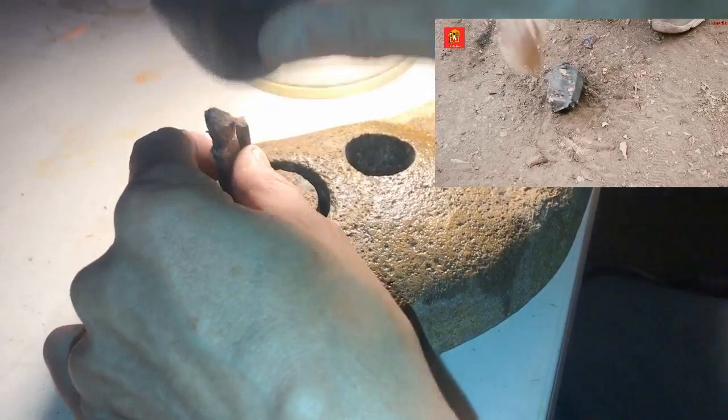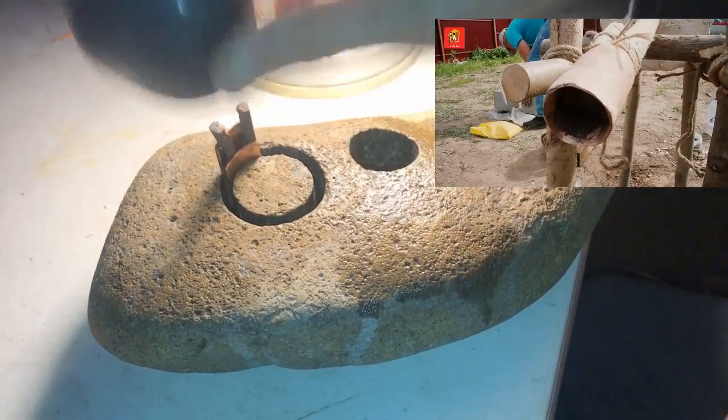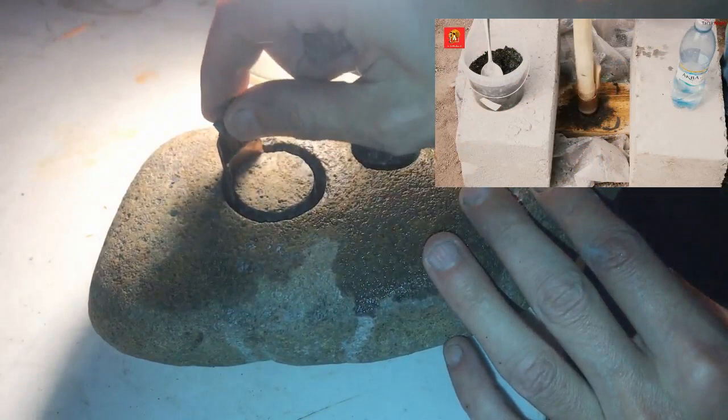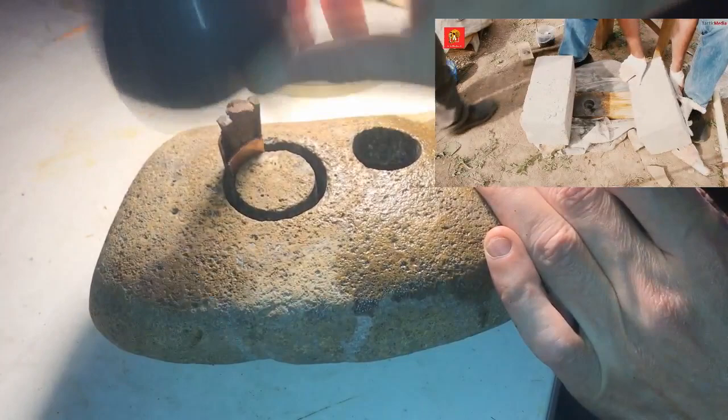the pipe will only be so long. But you drill down to that depth, and then you just pop out the core, and then you keep drilling down. So with a very short drill tube, you can drill as long as you want, as long as the wooden shaft is that it's attached to, and you only need copper and timber to pop out these granite cores.